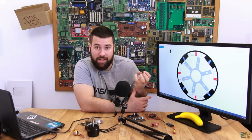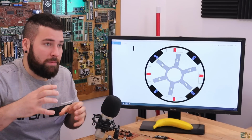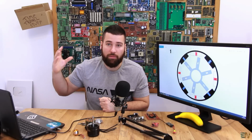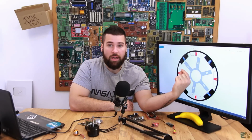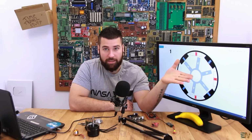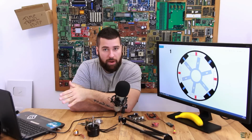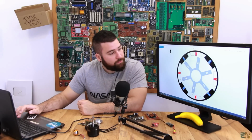this floating coil as a sensor, because as you all know, by Faraday's law of induction, when we move a magnet in front of a coil, we can induce current in that coil, and by that we can create a voltage drop, and we can detect the position when this floating coil passes exactly in the middle of the magnet. We will see that in the back electromotive force detection part, which will be in a couple of minutes. Okay, so let's just start.